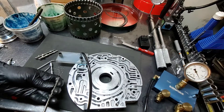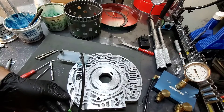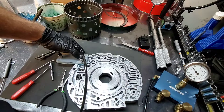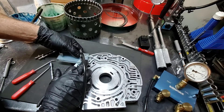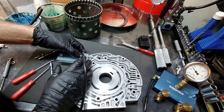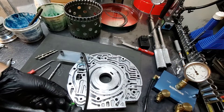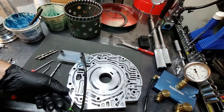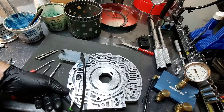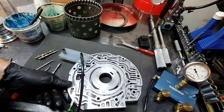With the known good valve installed, we're getting 22 and a half — same reading. They both read the same, so that means this pump is probably not that much worn. We have a little bit of clearance for the valve to move. We're at 22, and 25 is completely no leak at all, so we're in good shape.